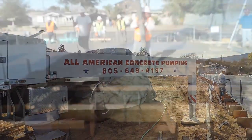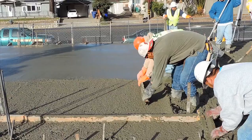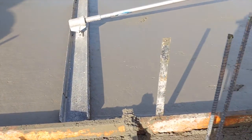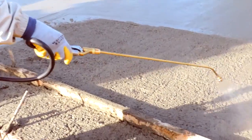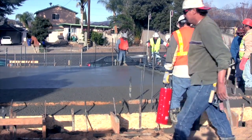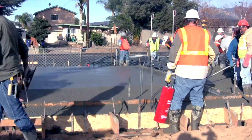When the fresh concrete arrives, place it and screed it off as usual. Do not add water to the concrete or bless the slab — you will not need it to close the surface. Spray on Day One, enough to wet the surface but not enough to form puddles. You should get about 800 to 1,000 square feet per gallon of Ready to Use mix.